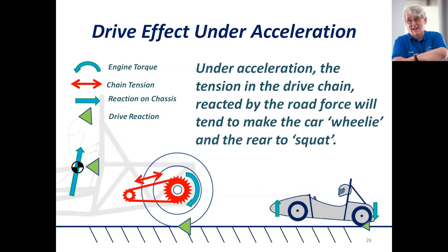This effect gets less as speed increases because the weight transfer to the rear decreases. It's at its highest as you move away from the start line in the acceleration event, then decreases as car speed increases. That's why judges watching the acceleration event can actually tell whether somebody has got a good run or not by how the car handles in the first two meters — if it gets off the line cleanly without doing anything squirrelly, it's probably going to be a good run.